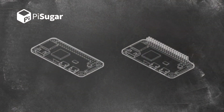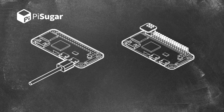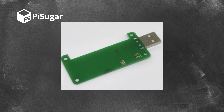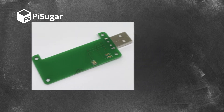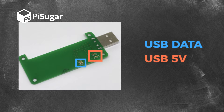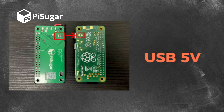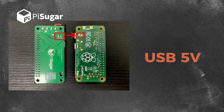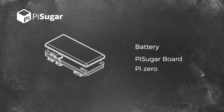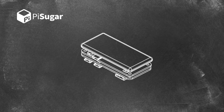There are several ways to power a Pi Zero. You can power it through a USB cable, or through a GPIO header, but they are taking too much space. We came up with a new idea when we saw this USB key designed for Pi Zero. Since it can connect 4 pins of USB, we can use 2 of them to supply power, as a USB cable does. In this way, we can save a lot of space, and make it very easy to install without soldering.